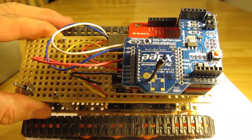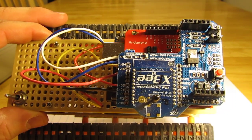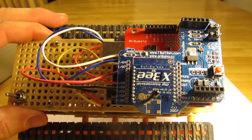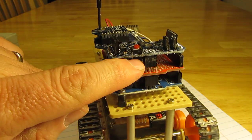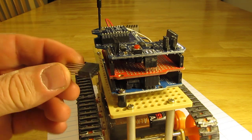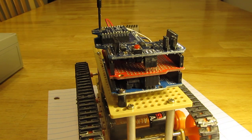I've got an XBee module that I bought from them. Now this other blue piece I found online — it's www.1belin.com and that actually came from China. It took about a month to get here but I really like it. It's a nice XBee shield. One problem I did have is the XBee shield needs power fed up through this header. The motor driver shield did not have that, so I bought this header material at a local supply shop, cut it down with a hacksaw to the number of pins I needed, and that's just placed right here. It's not even soldered in — it's just a press fit because all this stuff snaps together fairly easily.